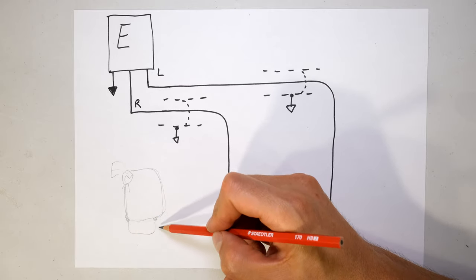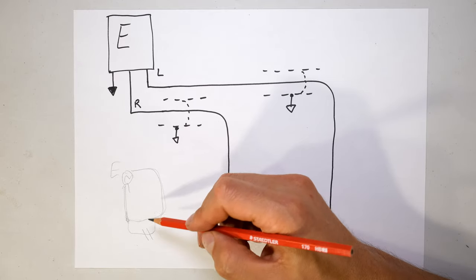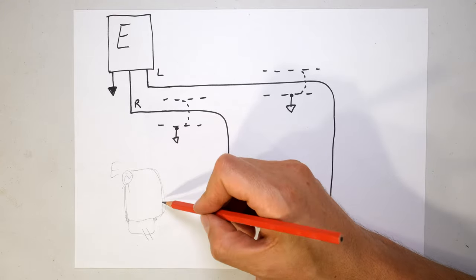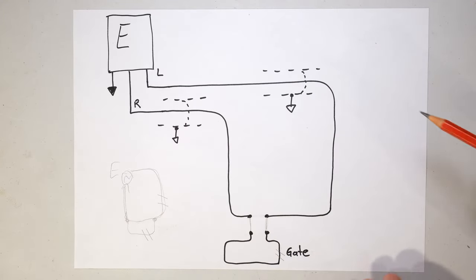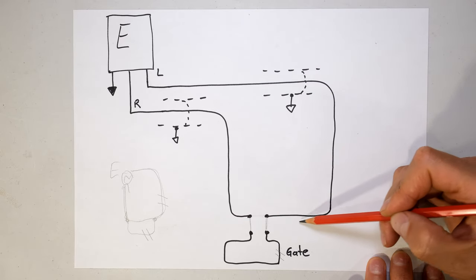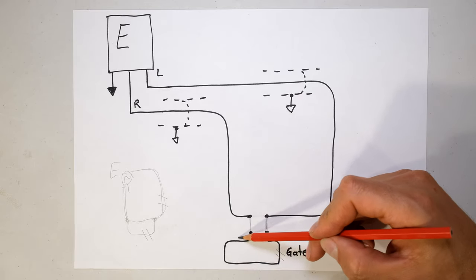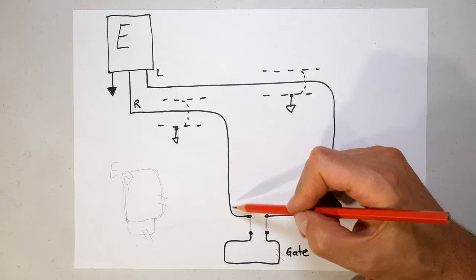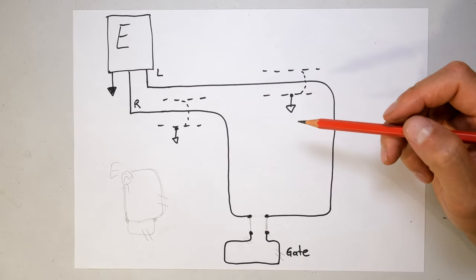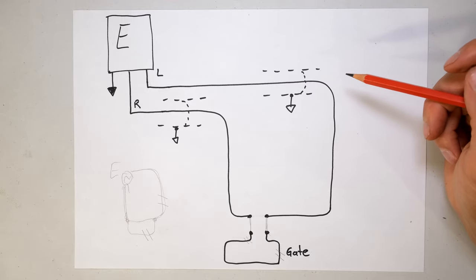There will still be a high voltage, but if someone had to climb on your gate and cut the wires, your energizer will not alarm. It will only alarm if the series circuit is broken. You can see the current flowing in series through the wires on the gate and returning. Any point on this travel - if somebody cuts the wires - the electric fence energizer will alarm. That is the principle of how you connect the gate section.